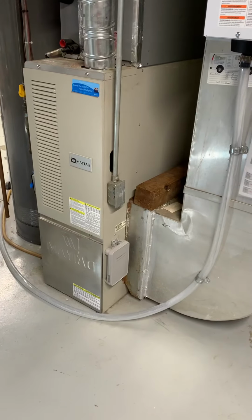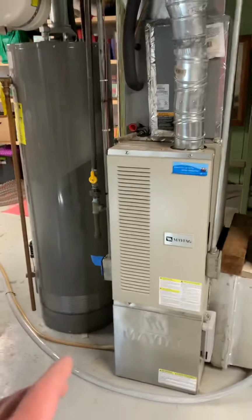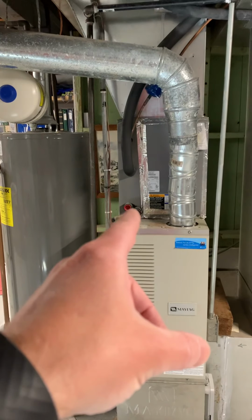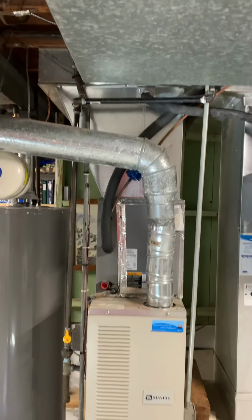We got a Vision Pro with the EIM already in place. Looking to do a new furnace. That's where they're having the issue with. And then we're going to do a matching coil to sit on top of it. They got an air conditioner. It's about 8 years old. They want to keep its 410A.